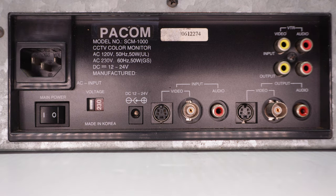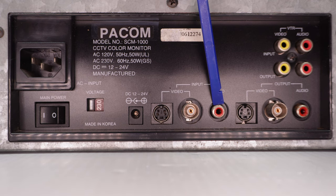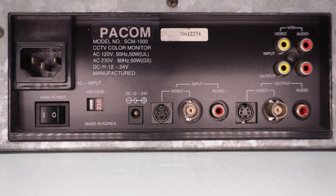There's a 12-volt socket — it can run on 12 to 24 volts, making it portable. Next to that is the input: S-Video and composite via a BNC connector. Audio mono in red — it's usually white, but older designs like the NES had a red audio output RCA. There's also an output set that mirrors the input set, and another set of inputs and outputs labelled VTR, so you might be able to run two things into this monitor. S-Video is the top signal we can put in.